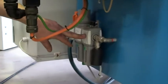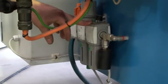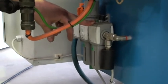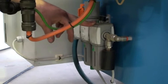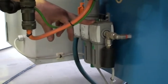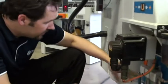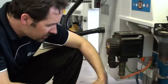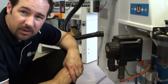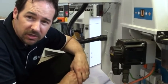The air service unit also includes a lubricator which puts oil into the air itself, lubricating things like the drills, movements up and down, valve movements — as all valves have seals in them. This creates a very small amount of oil through the lines, and you should see the oil going through roughly every one or two months. If after a couple of months the oil is still full, you know it's not working and it needs an adjustment.